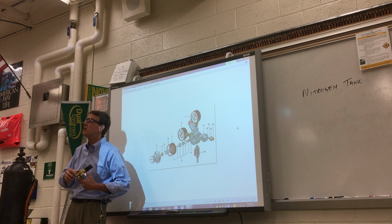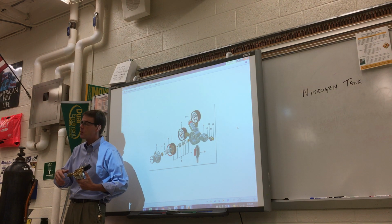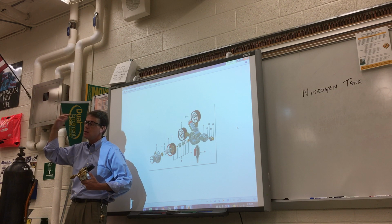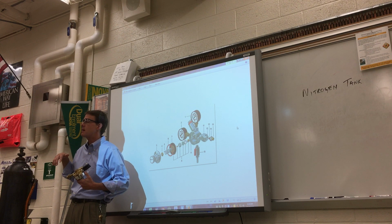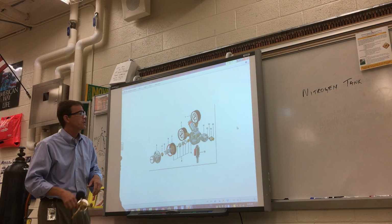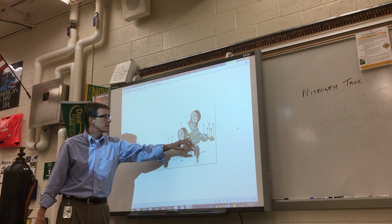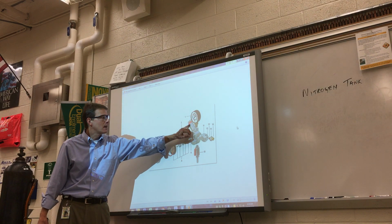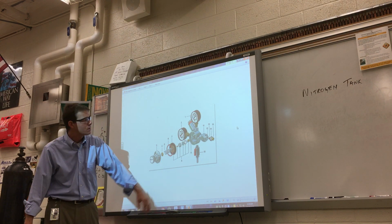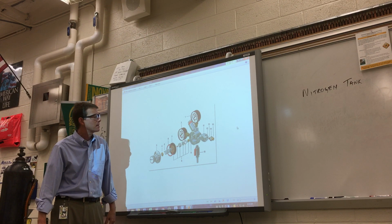There's a pressure relief valve on your water heater that whenever pressure builds up, because let's say the heating element didn't shut off and just keeps heating the water, it boils it to 212 degrees and that pressure has nowhere to go. So there's supposed to be a relief valve almost on any pressurized vessel. So that's what this piece is right here. And it can't be installed in series. In other words, we can't install it in line. Pressure relief doesn't work like that. It's got to be parallel with the system.